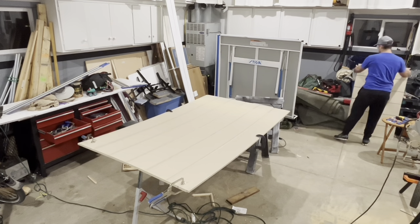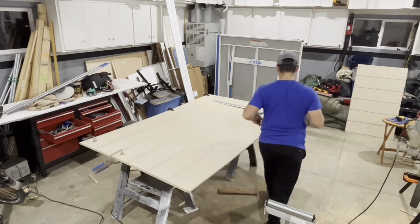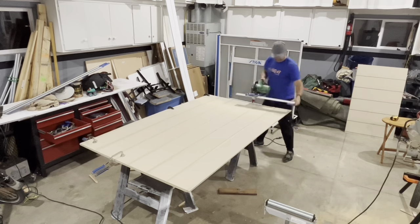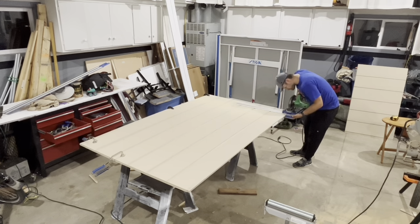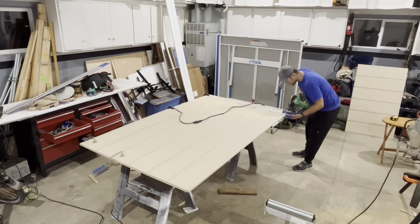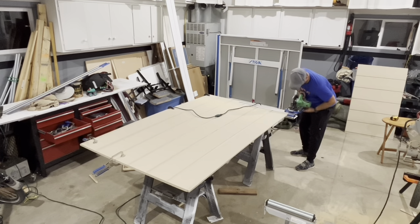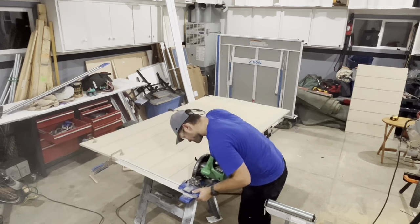For the long cut, the way my doors measured out, they're pretty much just under four feet — I think 47 inches was what my cut needed to be, so I really didn't have to cut off much. It actually pretty much just cuts off that little overlapping lip on these panels, since the panels are meant to be siding and have little lips that overlap each other. I did end up using my Kreg guide for this because the way the skill saw would sit on the panel, using the actual edge of the board makes a nice straight edge and made pretty quick work of it.